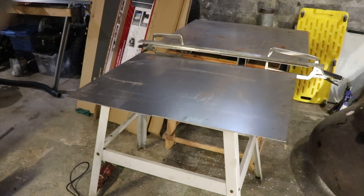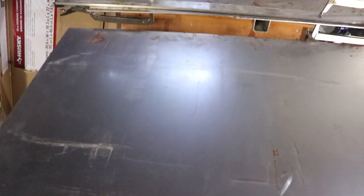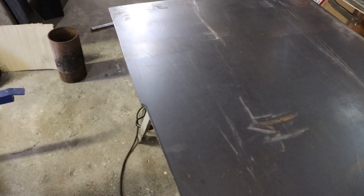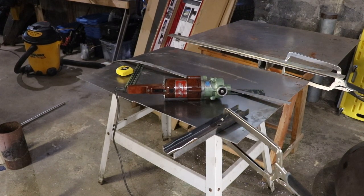Let's take this off here. So you can see I ended up with a jog — I don't know if my clamps moved, but it's quite possible. We got a pretty straight cut overall. It came from both ends, but that's part of the learning process. You can see the cut is straight enough. For what I wanted to do, that's way better than trying to use a grinder, a torch, or a plasma cutter. This gives a pretty good result. I just checked and there is a bit of waviness — my clamps were moving. I'd need to do that better next time for a better result.